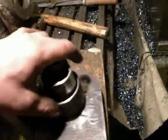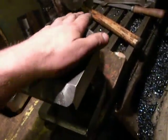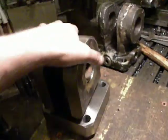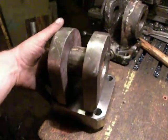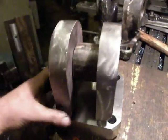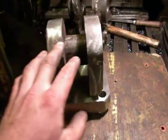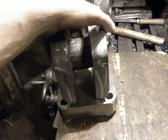I will mount it here, then I take a spacer and set it here, then I set another piece here and set it all together. I take a thumb screw and push it so — like so. In this way the pieces are not loose, they stay in place and the measures don't change.